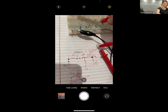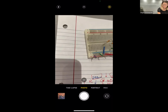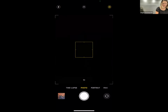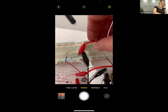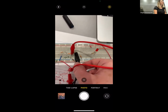So the plus side, I put that probe, and now I'm comparing it instead of from ground, I'm comparing it across the resistor. Sorry, all these are coming off. Oh, these clips are not very easy to work with. There we go. Okay. And yes, I do measure 3 millivolts there. So across this resistor, I've taken the voltage that I have at the positive side and I subtract off the voltage I have on the negative side across that resistor. That is the voltage difference.